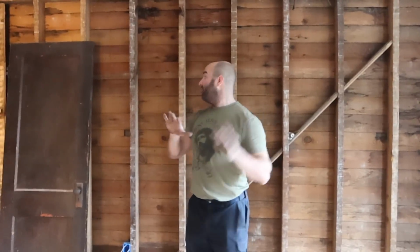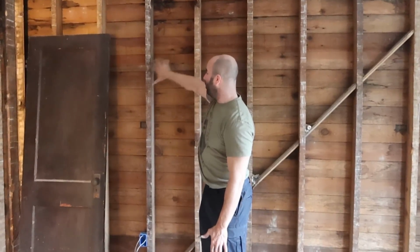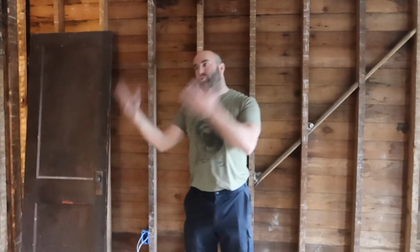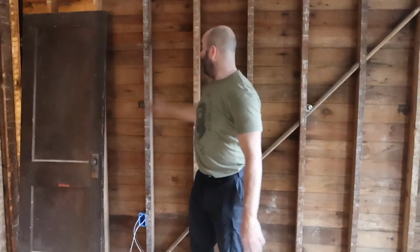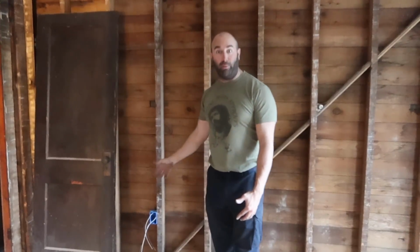Why are you taking nails out of the walls? I'm gonna tell you, because I need the insulation guy to come in and put up insulation, and you're gonna say, what's that got to do with insulation? Well, if we cover up the walls and they tack in all the insulation against the 2x4s, you're not gonna see any of the nails sticking out. And then the drywall guy's gonna come in, and he's gonna go, there's a ton of nails on the studs. How am I gonna put the drywall up? And he's gonna say, you can figure it out because that ain't my job, and I'm gonna have to come back here and take all the nails out of the side with the insulation already up. So I gotta get that done now, and that's what we did.